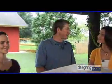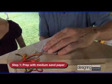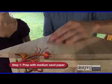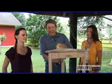We're all set up here, Bruce. Tell us what you have on the table. For Holly, I picked out a very easy project, and that's important for beginners because you want to work on something that's going to be very successful. This is an unfinished table. I like unfinished furniture because it is inexpensive and you can get it in lots of different woods, but the tips and techniques we're going to do here apply to any wood. Even though it is unfinished, we still have to do some preparation. We're going to take some medium-grit sandpaper and, going in the direction of the grain of the wood, sand it lightly. This will open up the pores and take care of any scratches it may have gotten in the store. Then we take a tack cloth and wipe off the dust. I've already sanded this, so we're going to move on to the next step.